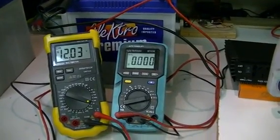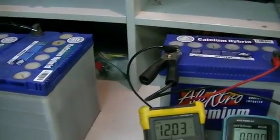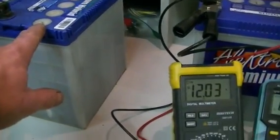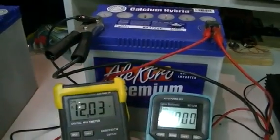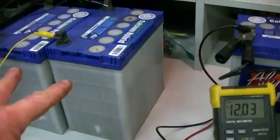In this next series of videos we're going to be looking at the three-battery so-called paradox setup, where we have two batteries in series, an inverter coming off the positive side of our series batteries, and then out of the inverter we go to the positive side of our third battery, and the negative side of our third battery is hooked to the negative side of our two series batteries.